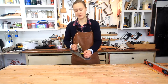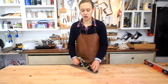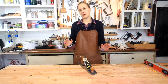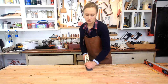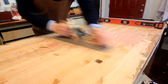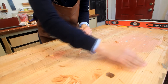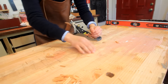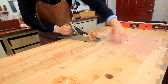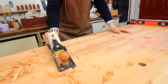For the plane, I like to start off with a rough plane first. This is a number five jack plane, and of course it's important to have a sharp blade for this. As we're going to take off the biggest amount of wood first, it's a good idea to start right across. You can see here where the pencil marks go missing — here was obviously a higher point and here as well, whereas in the middle it was lower. So as you work your way through, some pencil marks will still be there. This is the most rough you want to get.